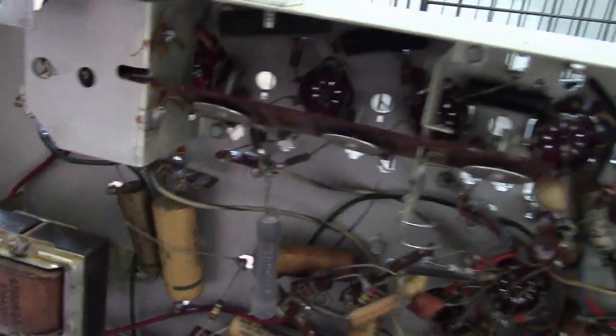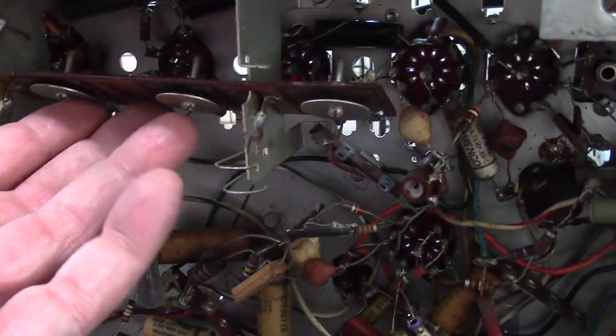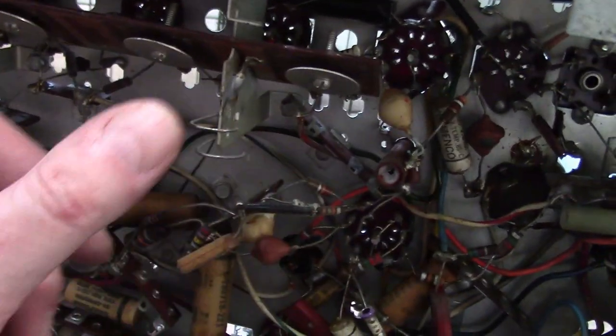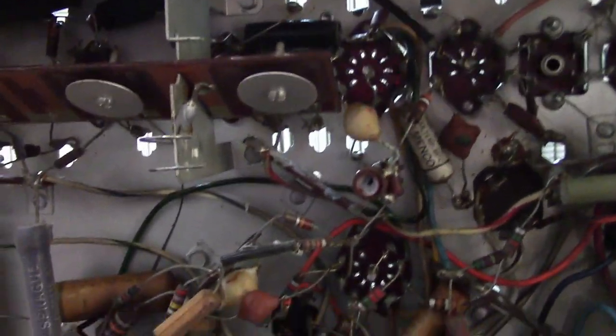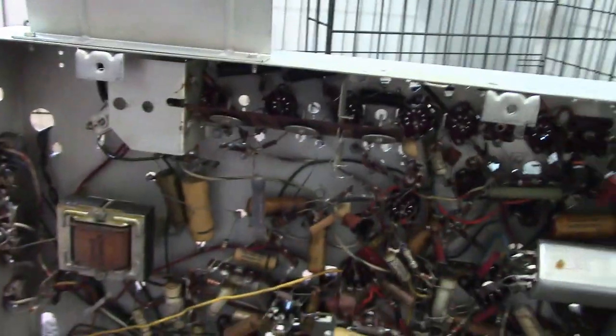There is some weirdness in this set. I've never worked on an RCA from this era. So this is a plate here — we have two prongs coming down. I assume these make contact with the bottom of the cabinet for grounding. And then there are trimmers. I'm pretty sure that's the video IF strip, which apparently doesn't use adjustable coil slugs — it uses capacitors, and those are the adjustments as near as I can make out. Strange.